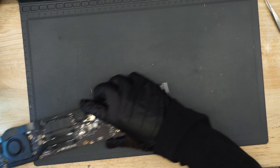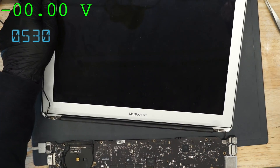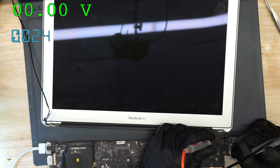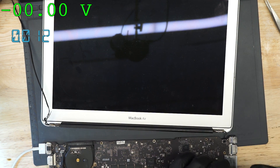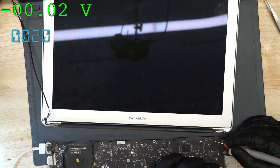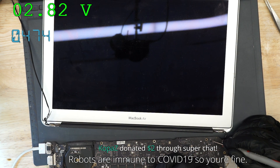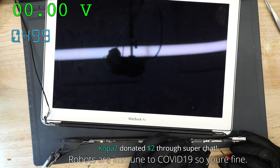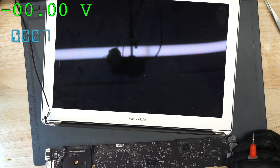Let's try some things with a test screen. Is backlight enabled present? We have 2.8 volts on backlight enabled, but still no backlight. And we're stuck at 8 volts, which means we're not boosting. Backlight voltage appears to be 8 volts. I'm going to go with LED driver randomly decided to shit itself.